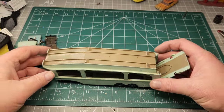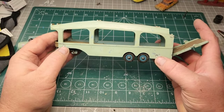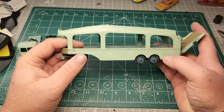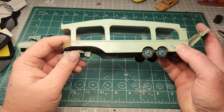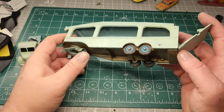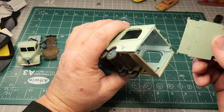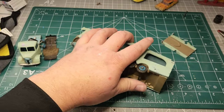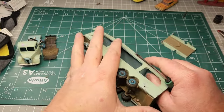Right, so I've gone ahead, I've just drilled the tops of the rivets. Obviously I've had to get rid of the post piece that's going through the outer casting. We've done that, I've just gone round it slightly, it has started to pop off, so hopefully now, there's the door off, we should be able to get this out. Have a bit of luck.